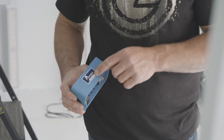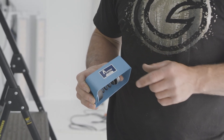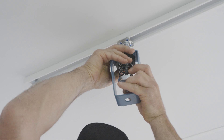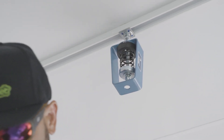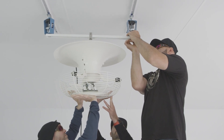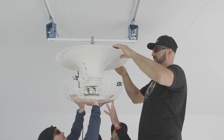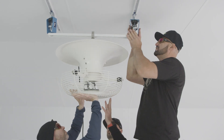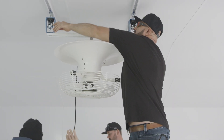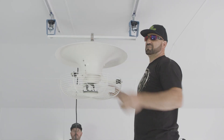Now we put the isolation dampeners in place. They're made by IR Systems and the model SA25, which means this is rated for 25 pounds — we're doing 25 pounds per each side. It's always handy to have a couple extra hands when doing these things; you can always use a strap if you don't have somebody to help you. Now that is completely free of vibration, which is really nice.